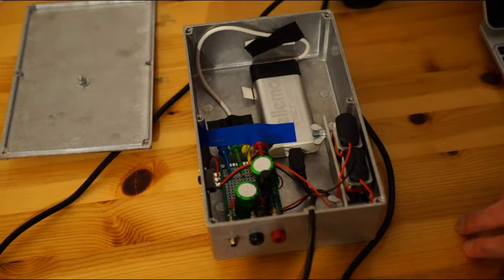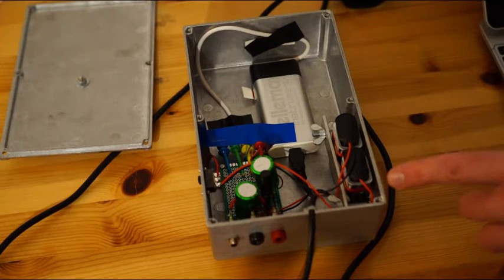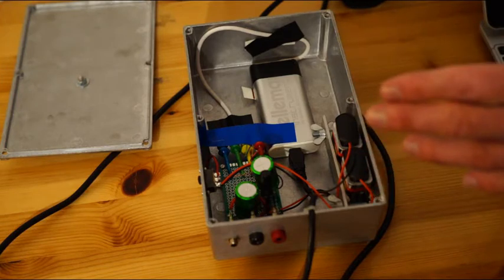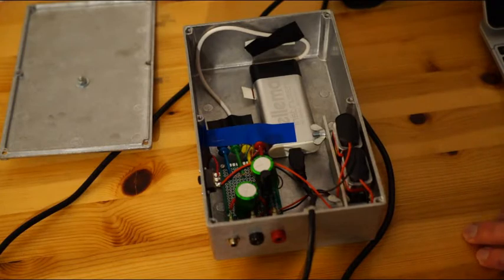On the output of the amplifier circuit there is a high-pass filter. This is mainly an unprofessional solution to get rid of bias voltages. I use a simple RC high-pass filter with a 470-kΩ resistor and a 1000-microfarad capacitor. The characteristic frequency of this filter is below 1 millihertz, so it does not affect our sensing — it just removes voltage offsets.